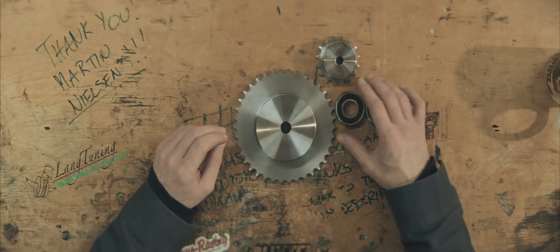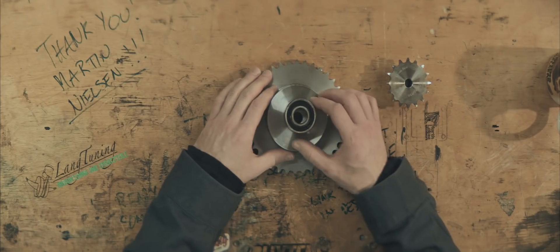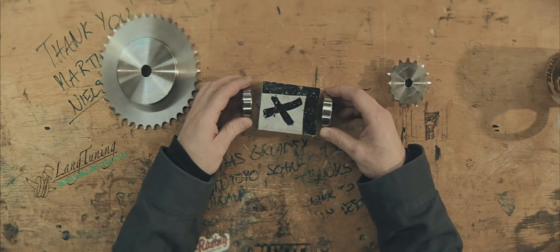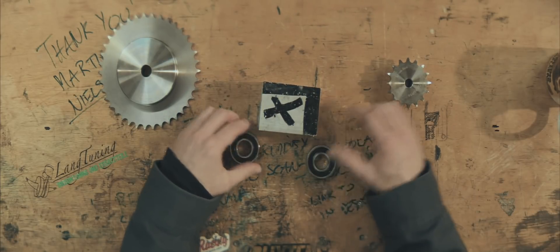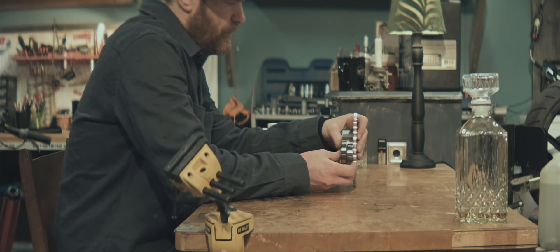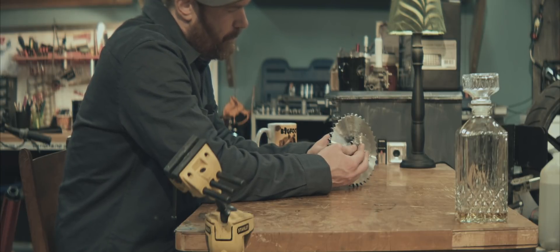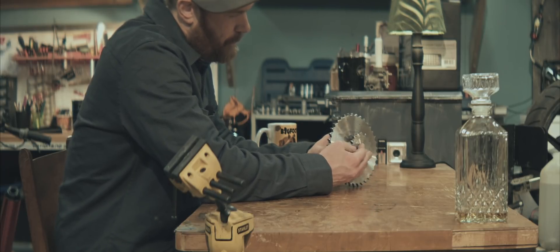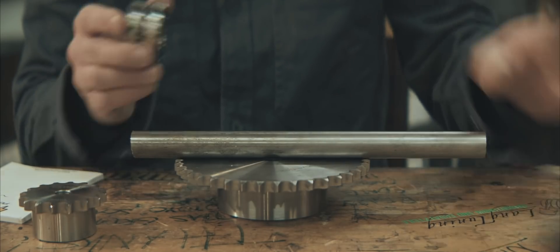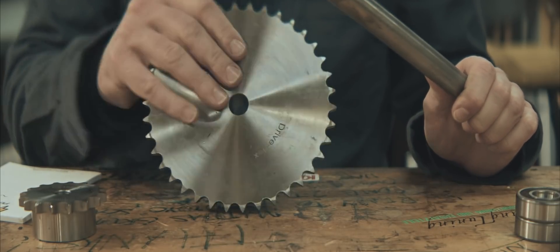There are two ways of doing this. I can either mount the sprockets to each other and mount the bearings in the sprockets, or mount the bearings in a bearing block and mount the sprockets to the shaft. I think there's room for mounting the bearings inside the sprocket — machine a little recess and weld the smaller sprocket to the bigger sprocket. I think it's better to make a bearing block, though, and attempt machining a keyway in this sprocket.